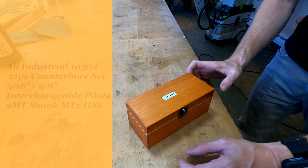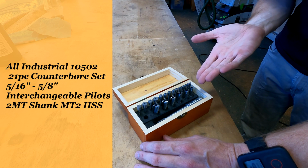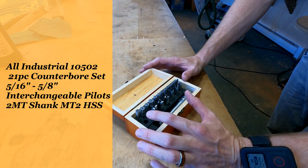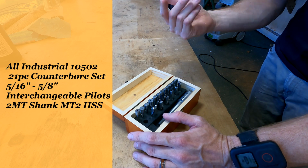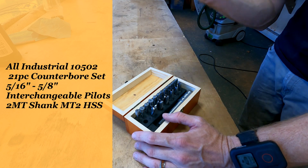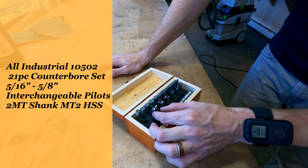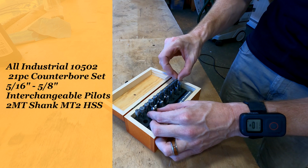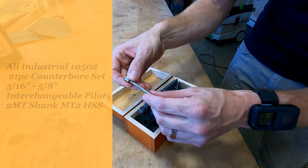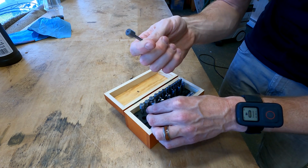And in the new tool department, a new set of tools that I've purchased are these counterbores here. These are for cutting counterbores in your tuner holes, or really for counterboring any kind of hole, but that's what I got them for. The way these work, you can see I have many different size pilot holes here. These are smooth and are just your guide. These ride in your existing tuner hole.